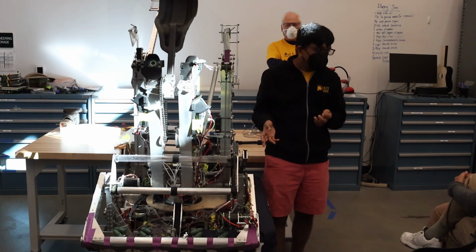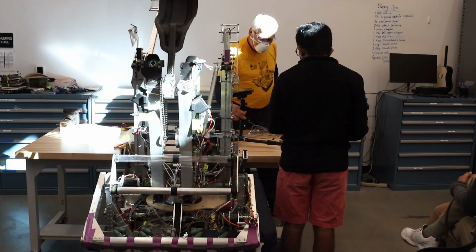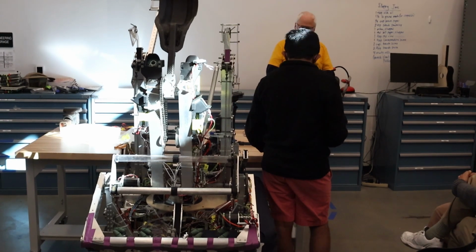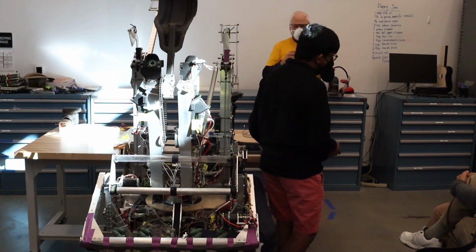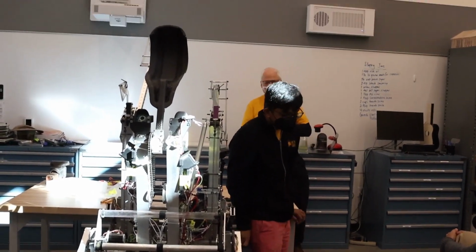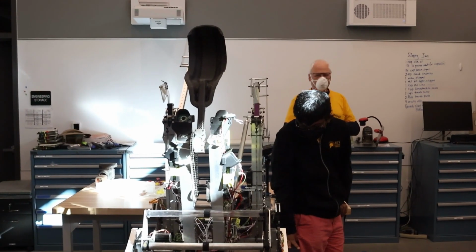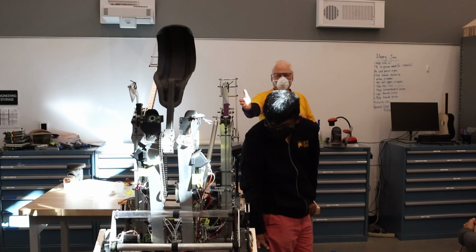So in this case, the pot failed. It broke off. So each team has their little prejudices. Our team, due to mentor history and so on, we do not like limit switches, because there's a belief or a superstition that they fail. So we don't. I haven't seen a robot in my 12 years with a limit switch on it. We just avoid them, and so you notice we have potentiometers.